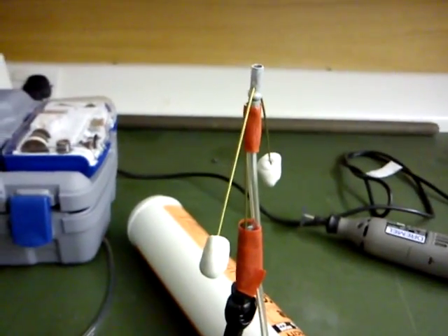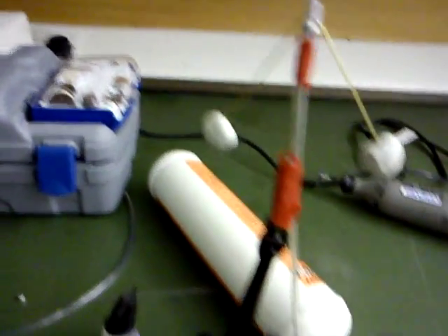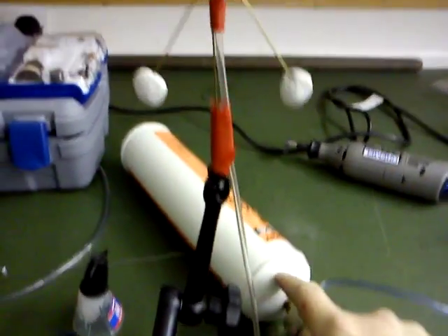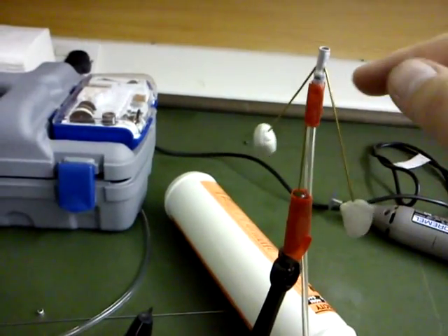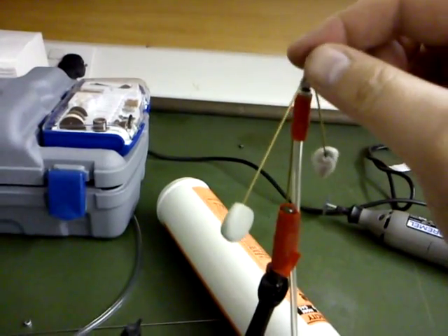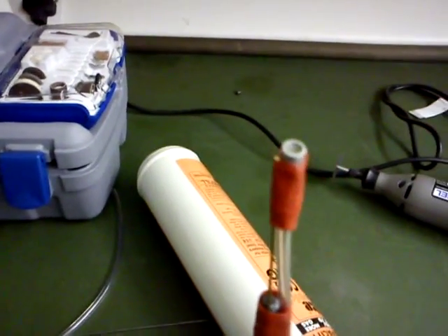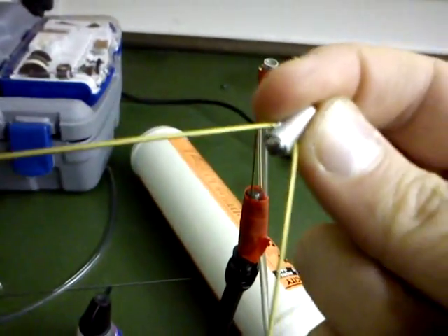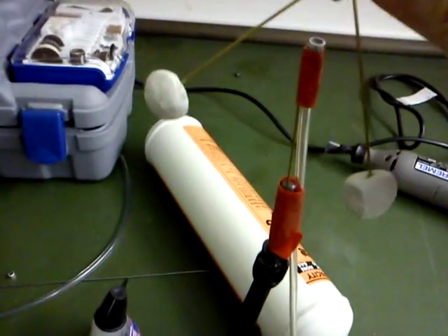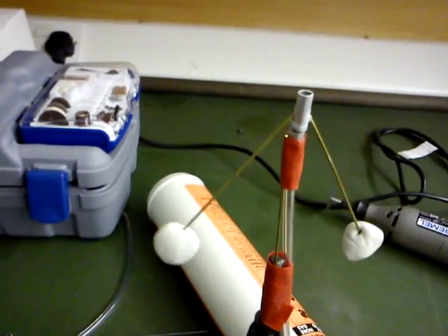This is a spherical air bearing. It consists of — I'm using CO2 as the gas — a piece of flexible tubing, a piece of aluminium tubing, and in the end of that I've made a kind of ball-shaped cup out of araldite, which was cast using a ball bearing. In the bottom of this is the ball bearing, and I drilled a 0.3mm hole in that epoxy.